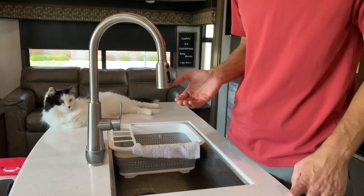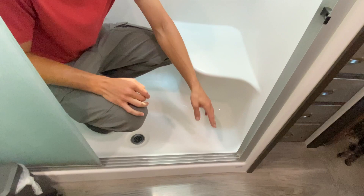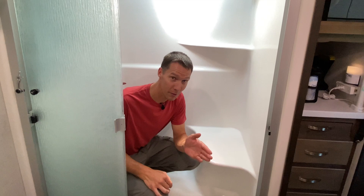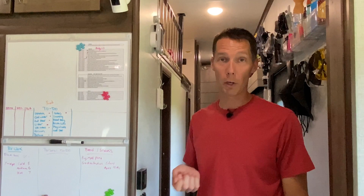If you have a washer and dryer, check those connections for leaks as well. In the shower area, look at all the silicone around the top and door area — make sure nothing is missing and no gaps are present. Check that all screws are secure and go all the way down the track to the bottom. I've seen showers installed the wrong way where water drains out to the bathroom floor — definitely get that fixed before your first shower. Also check all your light switches, turn them on and off, check dimmer switches and fans, and don't forget the switches that control the outside lights.